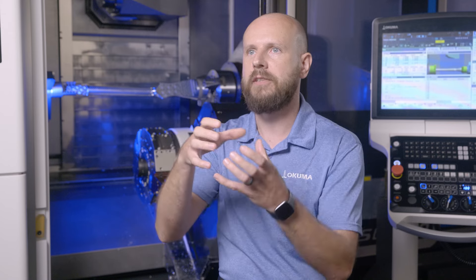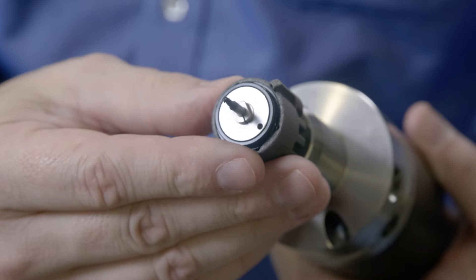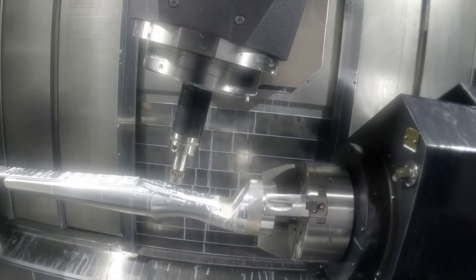Another benefit of the SpinJet over an air spindle is that coolant is a lot more dense as a liquid than air is, so instead of a large bulky air spindle which could lead to a lot of clearance issues, we have something that's about an inch and a quarter in diameter. It's metal 3D printed — which is really cool — and has a coolant nozzle that blasts right on the tip of your tool, so you're not only spinning your tool but you're keeping it cool, directed right to the right spot.